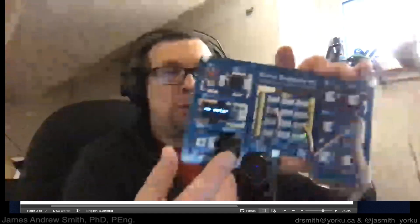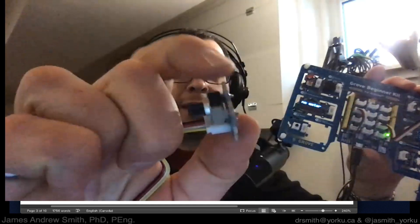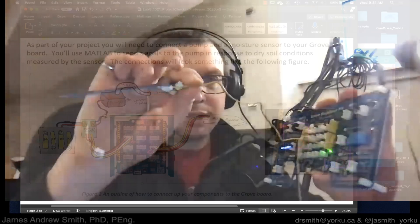There's a trick with the moisture sensor that you may already know from a previous course: you either have to swap the two signal lines — the yellow and white lines — or you can pop out the small potentiometer on the board. The board has perforation lines on the edge that allow you to knock it out using a screwdriver. Once removed, you can connect the potentiometer separately without having to swap the yellow and white wires. Either approach works — if you're unsure, ask the instructor or technicians.